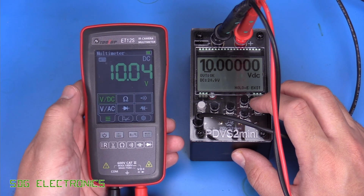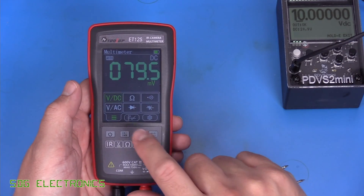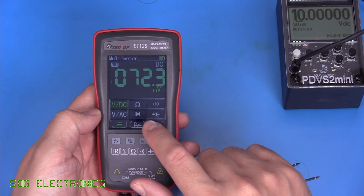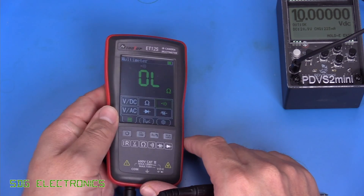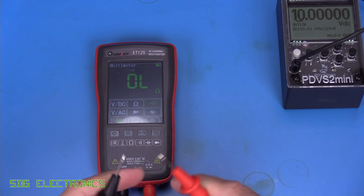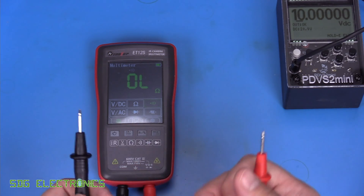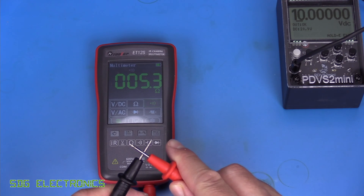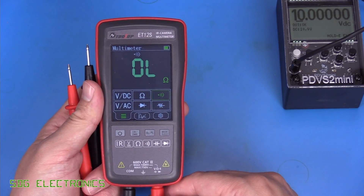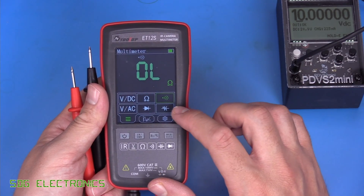Up to 10 V — going slightly off there, but certainly not too bad at all. This one doesn't have an ammeter measurement, so there's no risk of accidentally shorting out the mains if you're probing around with it set to the wrong thing. In continuity mode, the beeper appears to be directly tied to a very simple circuit — it's not latching or anything like that. It takes a moment for a real reading on the display, and the beeper is quite high-pitched, so some older people might have trouble hearing it, though it's certainly not obnoxious.